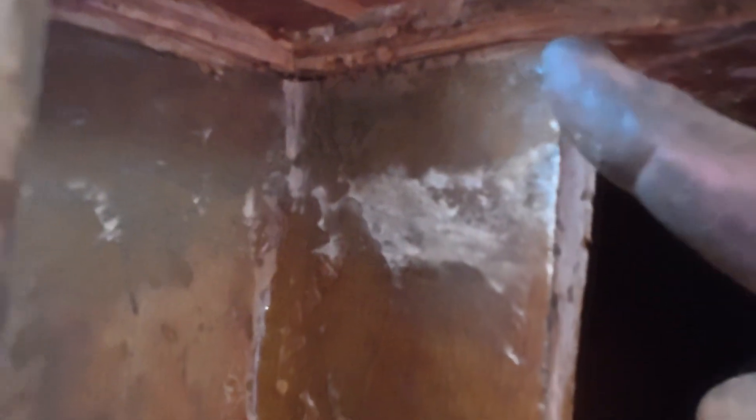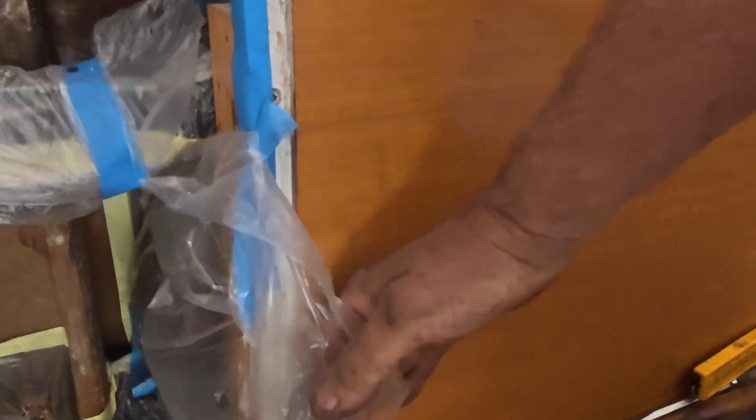You can see here the famous plywood that you need to remove and replace with a solid fiberglass plate — right here. You can see the compression. The weight actually deflects towards the back of the boat, and eventually bends all this section, all the backrest. That's why a lot of boats get deformed in the corners.